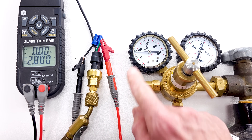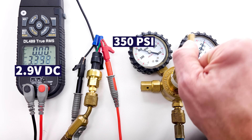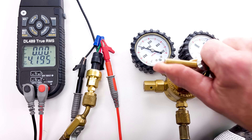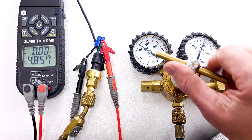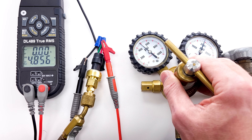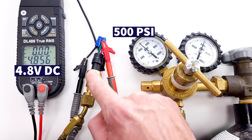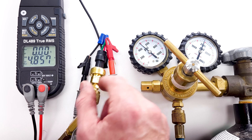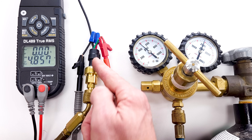At 350 psi, we're reading 2.9 volts. Increasing to 400 psi, we're at 3.5 volts. You can see our gauge isn't working properly — I think it's getting stuck because I have it resting on the table. At about 500 psi, which is the maximum pressure this transducer can monitor, we're maxed out: 4.8 volts coming in on the red wire, and now 4.8 volts coming out on the green wire.